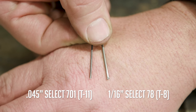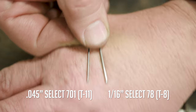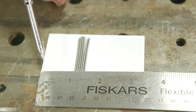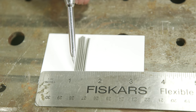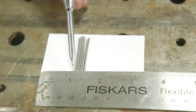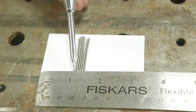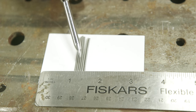We've gotten a lot of questions about this wire — everybody wants to break out the big boy wire, so that's exactly what we're going to do. When dealing with different types of wires — be it flux core, metal core, or even solid wire — a good rule of thumb is the weld should be about five to six times the diameter of the electrode. Since we're running the 1/16th wire, five to six times — the math is really simple — I'm going to run it to about 5/16ths to 3/8 inch wide on my weld.